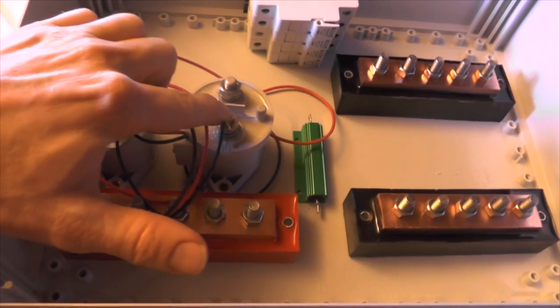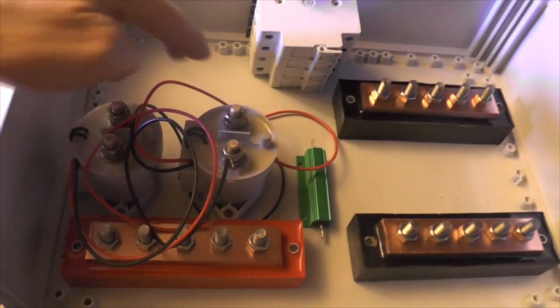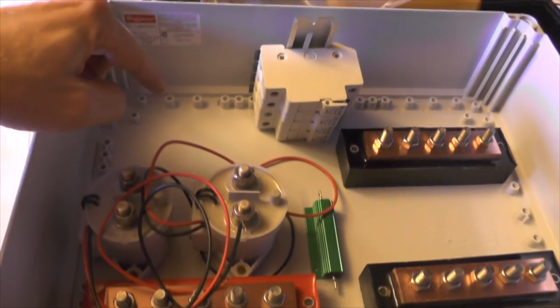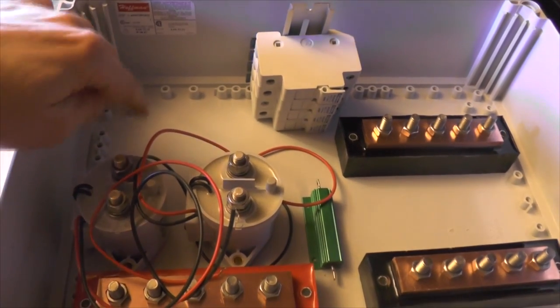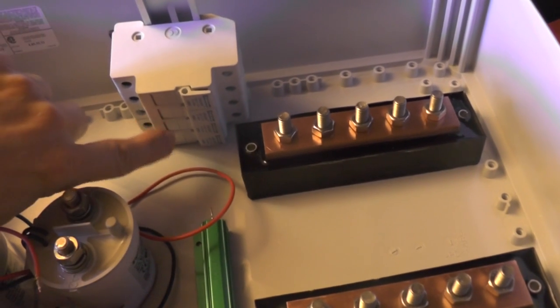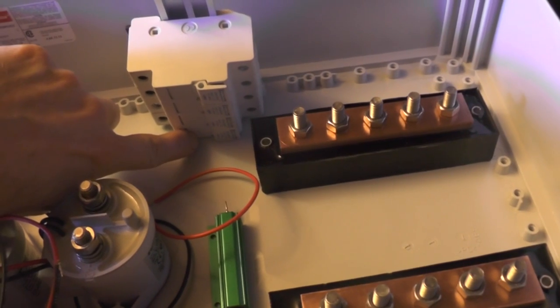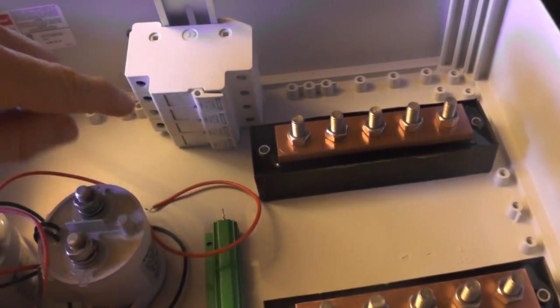This will be the heating contactor, pre-charge resistor. And then the next red bar will go here. And from here, directly out to the motor, to the motor controller. And the rest will go to the fuse boxes. And it's four fuse boxes, one for the DC-DC, charger, heating, and the JLD-404. 20, 20, 20 amps and 5 amps.